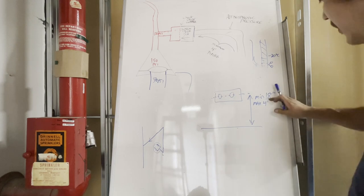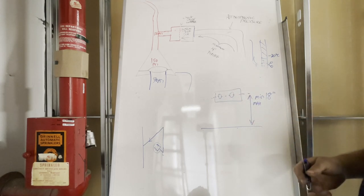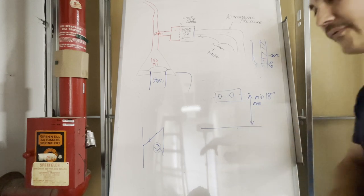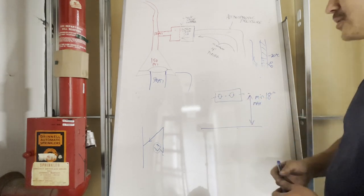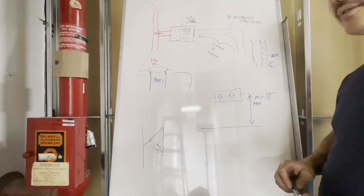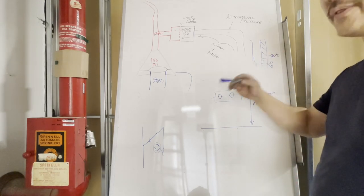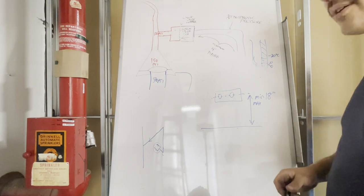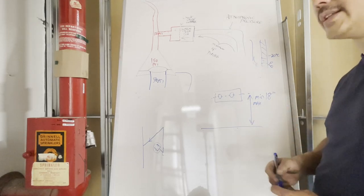I don't know why Ontario's maximum is three feet — I think four feet is better. The only reason I can see is they don't want the connection so low that firefighters have to hook up their hoses really close to the ground. I say the higher the better, especially in Ontario, because we get monstrous snow banks. I always aim for about 35 inches — don't go right to the maximum so a stickler inspector can't call you out. I think Ontario should change it to match NFPA four feet, but that's what it is.